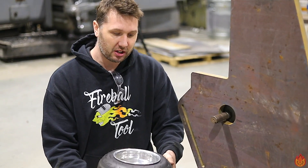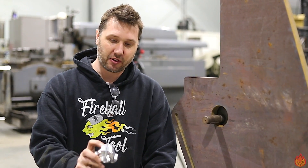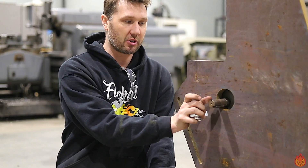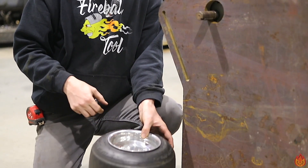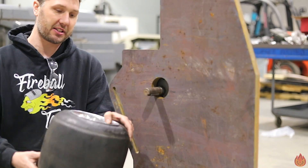For the drive wheel we're going to drive it right off the shaft. Normally if this was for a go-kart it comes with this hub, but because of the offset of this wheel and the shaft length of the motor we're about two inches short. So I'm going to build an adapter that slips over this shaft and reaches the inside of this wheel to give us the offset that we need. I think this is going to work out slicker than snot.